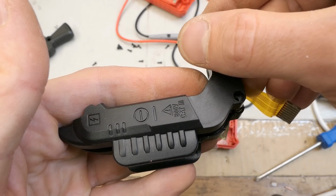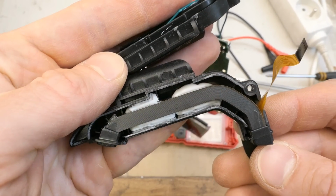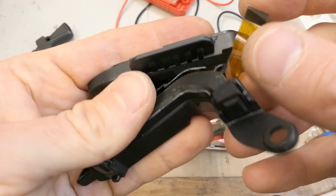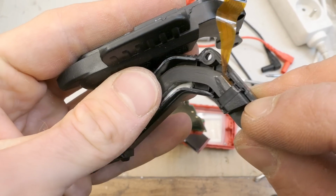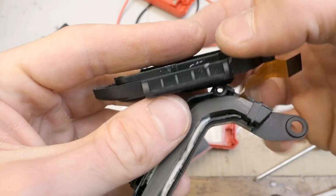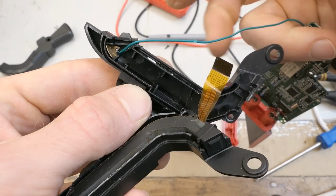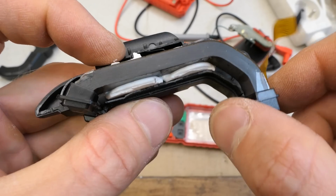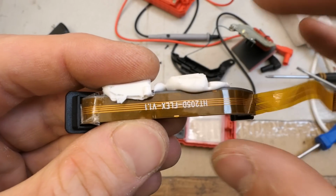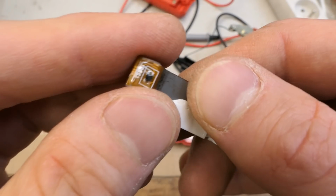Well, I finally decided to pry this one open anyway. And here is the iron core, made of iron layers, glued in. And the whole sensor is on it. Probably here, under this plastic cover. And here is the wire going to the antenna for the non-contact voltage detection. And removing this. And this might not go back together, but anyway. Here is the iron core with this connection. It seems to have two hall sensors, one on each end.